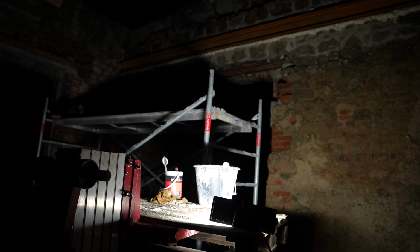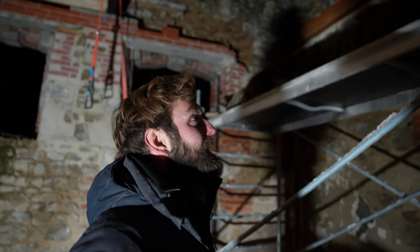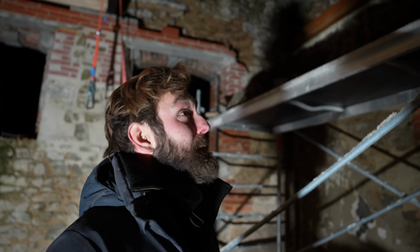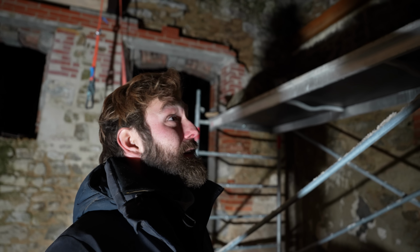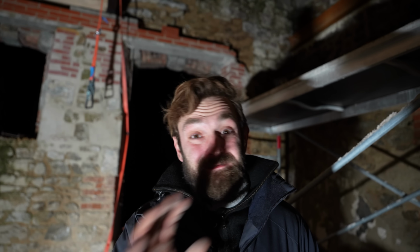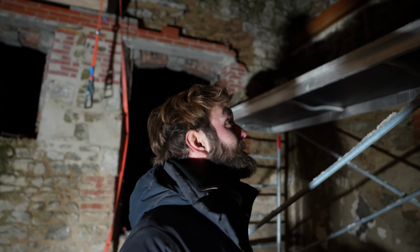Ignore what I said earlier, I've just realised they haven't got enough paint to paint the steel beam before I put all the wood in, which really needs to be done. So I'll get Nick to pick that up in the morning when he's on the way to me. So tomorrow, paint the beam first thing, get all the wood in, get the holes drilled, get it pinned and resined into the wall. And then hopefully that leaves me one more day with Nick and Cameron to get any materials up for the roof that I need. And, you know, hopefully nothing hinders that.